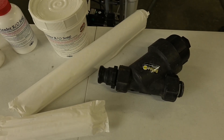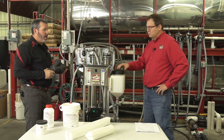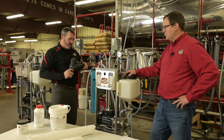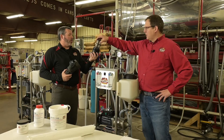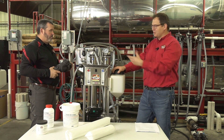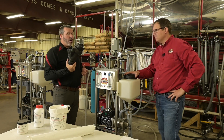Talk a little about this Y strainer — this is a big one here. Y strainers are very important. You want these coming from your tanks to your machine. What can happen — you can get mice bringing in seeds. I've seen seeds in pumps before. As long as you've got the Y strainer in there, it's going to collect all that before it gets to your machine and prohibit any problems down the road. This strainer can plug up, and when that plugs up, the machine won't run. Sometimes the problems you might think happen with your machine are just a matter of the Y strainer being plugged. This catches slime and a bunch of different stuff before it gets to your machine. It's strongly recommended to use one of these.